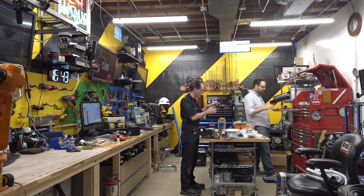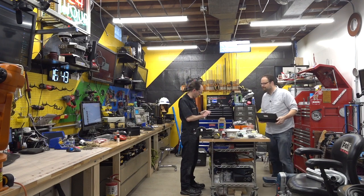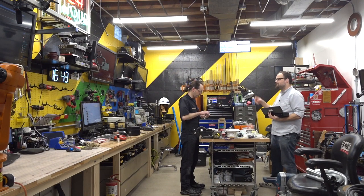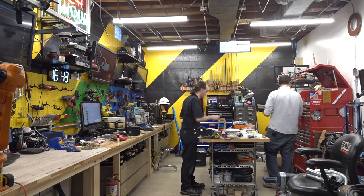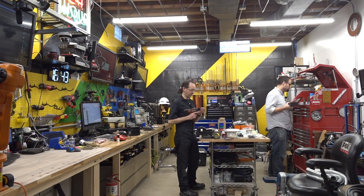It has to do with how much meat your tap can deal with cutting. That's a proper tap. All right, we're at 0 millimeters there. So this is 3.57 millimeters, the new one. The one we just broke, which was the number 29, is 3.44. Okay, I think we'll live. And if not, that'll be fun too.